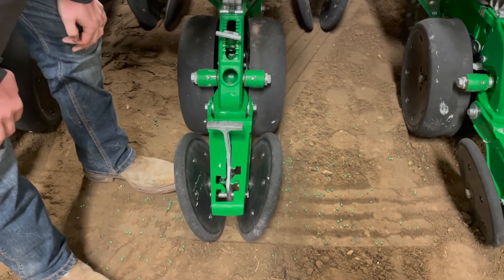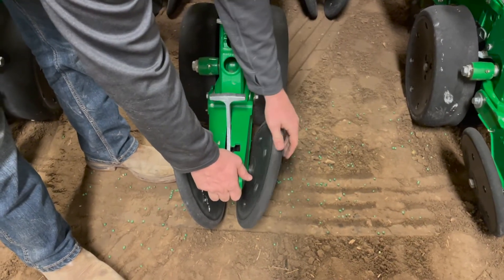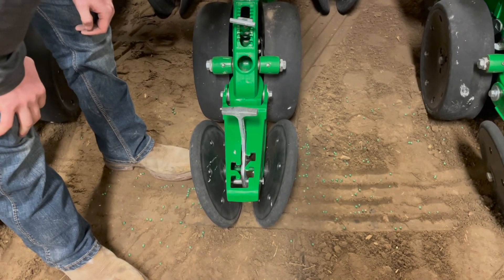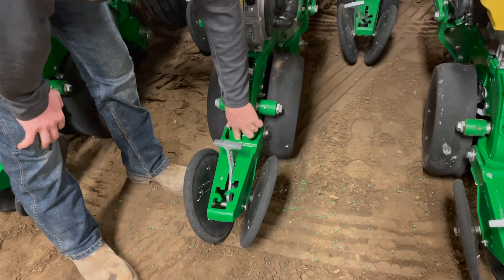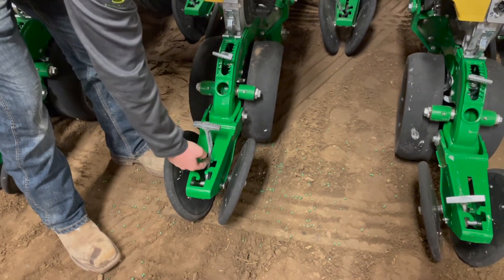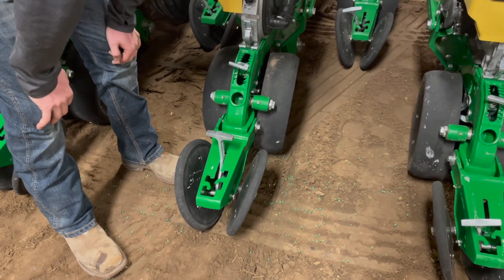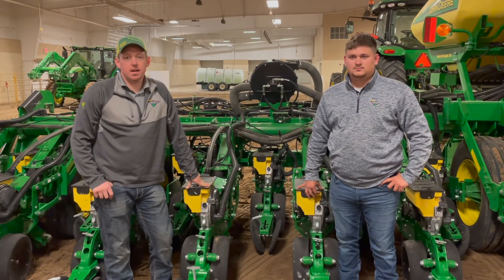Some other issues that occur on our closing wheel frames are just bearings on these — give those a spin, and if you're getting any resistance or grinding sounds, it might be time to replace your closing wheel bearings. One other thing is the spring where it attaches up front — the cast pieces can get worn out, so get a good look under there and check that loop to see if you're getting any wearing, so you don't get the spring pulling through that cast piece. If you have any questions about anything we talked about here today, please feel free to contact us at your local dealership.